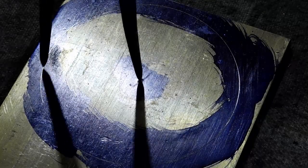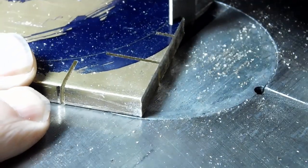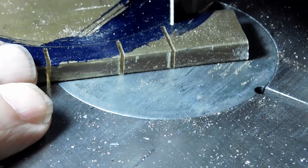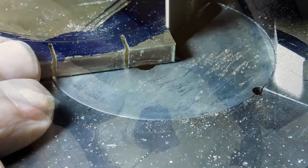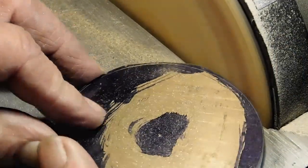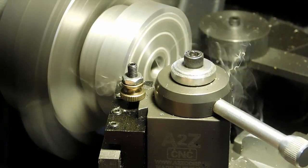We're going to set up the gear blank — this is a quarter-inch piece of engravers brass. On the bandsaw we're cutting out a rough shape, getting it as close as I can, then moving it to the sander. I just don't want the interrupted cuts to be too much. Now it's on a piece of glass being sanded flat, just enough to get everything clean.